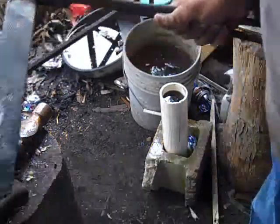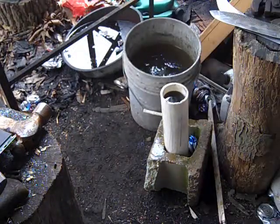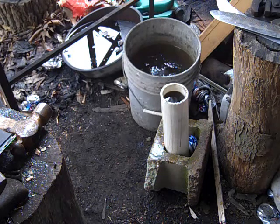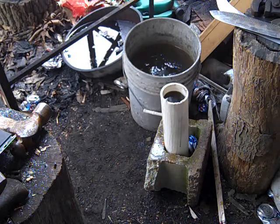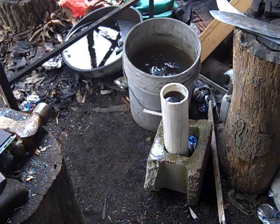So if you're going to try this, hold it like that so it doesn't get you. I've never used a gas forge. I like charcoal just because I like charcoal, I like the coal fire. But this is where the advantage of a gas forge really comes in, since you've got the ability to heat that whole thing up nice and smooth and even. Whereas on this, I have a real small pot, so I can only heat about a six-inch area really evenly. So I do have to keep moving my knife back and forth, and anything large that I try to heat to a constant temperature, I've got to move it back and forth quite a bit to get that even temperature across there.